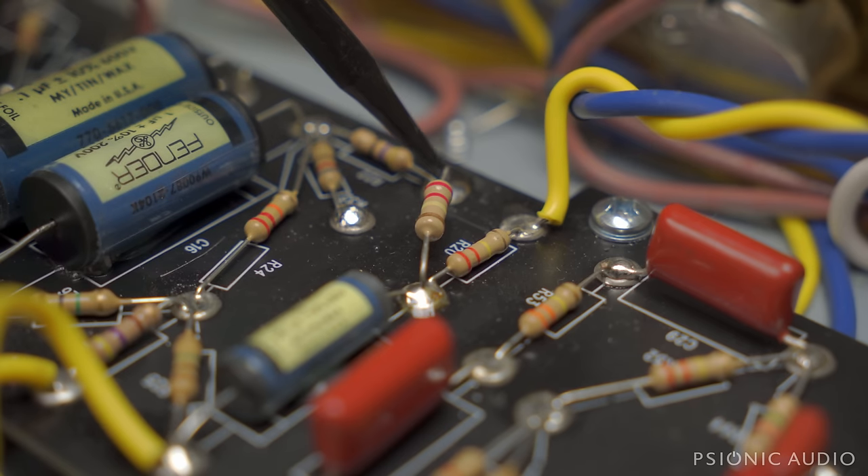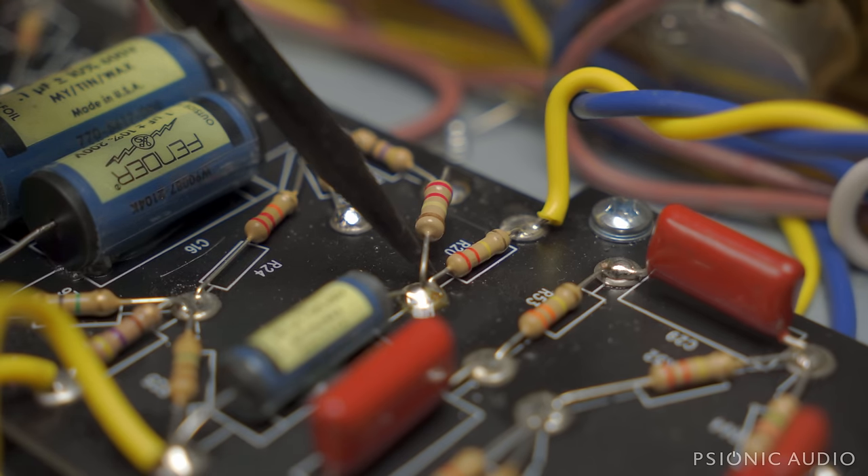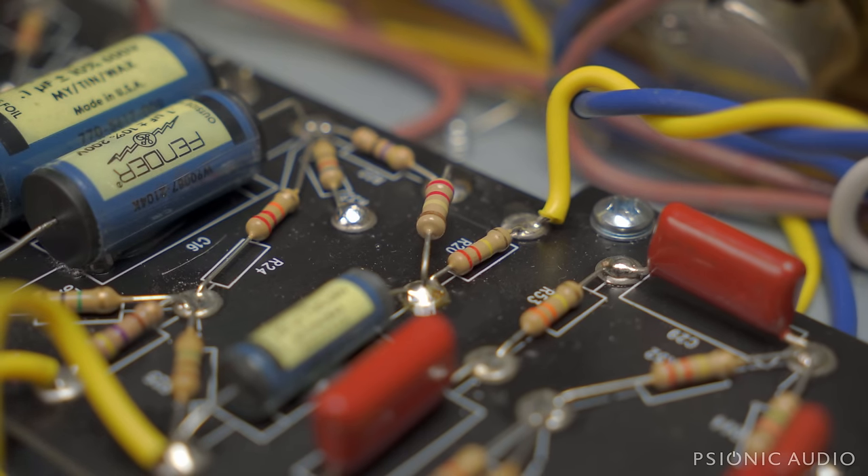There's still plenty of overdrive and grit — you'll get to hear that when the owner demos the amp — but it lowers the noise floor dramatically and gives you a lot more clean headroom without sacrificing the things you want. It's also easily removable if the owner later green-lights a level 2 or level 3 repair, where I could put reverb and tremolo on both channels without the noise floor, in which case I would have mix resistors earlier in the preamp so this one would not be necessary.